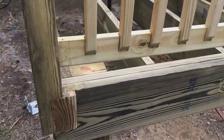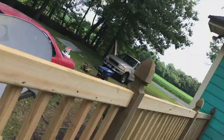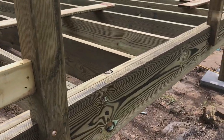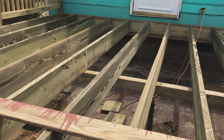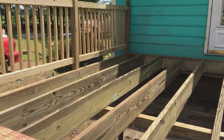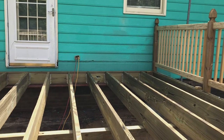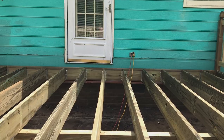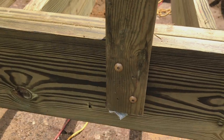Doubled two by tens. I did carve out a chunk on the two by sixes so that you could rest these on top of them — they're partially rested there on top. Doubled the whole exterior — two by tens, treated. I put a post down the middle; it has three supports on it. You can see it's metal — you can actually get those at Lowe's for about thirty bucks. I used joist plates to hang all the joists, and big long screws with my impact driver.